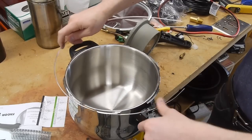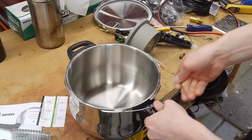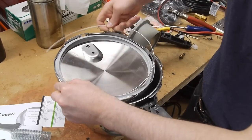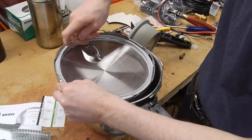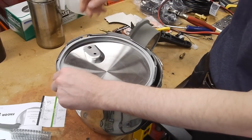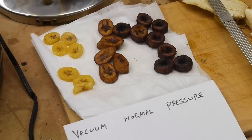To fix this, I took a piece of stainless steel welding rod, bent it into a circle, and under spring pressure placed it inside the seal so it would hold the seal out to the outside — and this actually worked fine for a while. After a couple of runs, enough oil got around the lid area that the seal became slippery enough to pull itself in when vacuum was applied. So if I were to keep using this setup, I'd need a stronger ring, maybe a continuous ring, so it won't collapse in on itself.